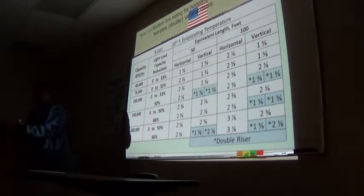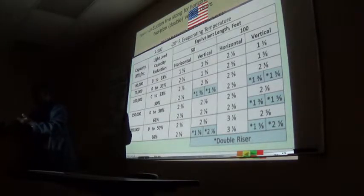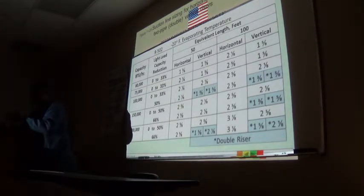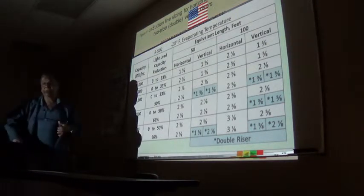But the whole bottom line is load, because I always ask the customer, what do you plan to store in here other than the usual things? No, we just, you know, vegetables. Meat you put to marinate overnight, it's not gonna be frozen stuff. Let's say it's a regular 35 degree walk-in. You find out exactly what it is, and you get an average idea what the load will be, and you work on the box. More often than not, 99% of the time it works out. Simple, easy.